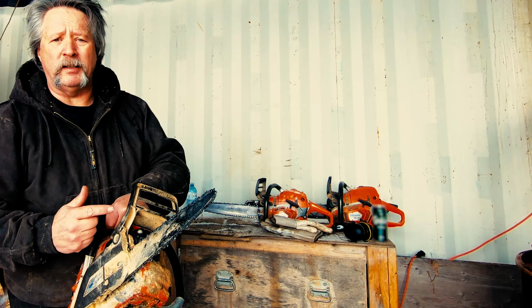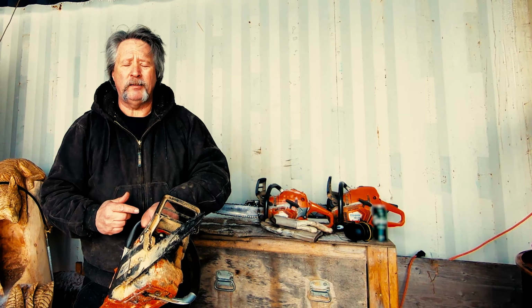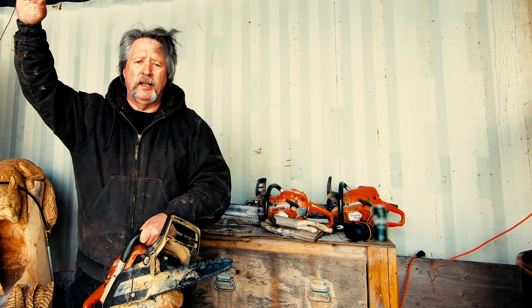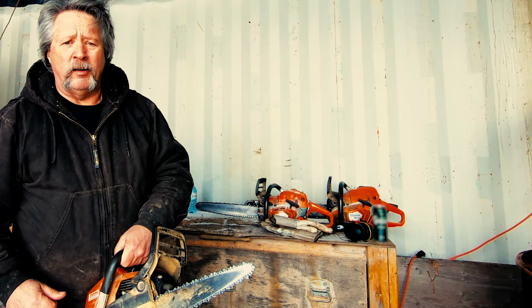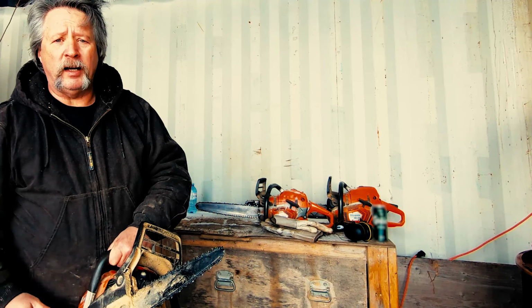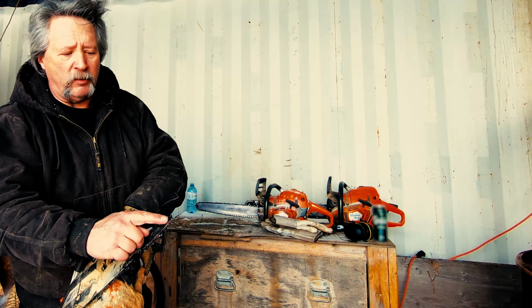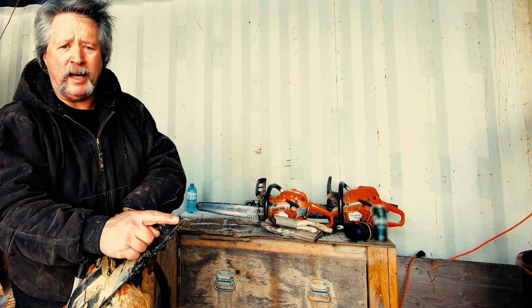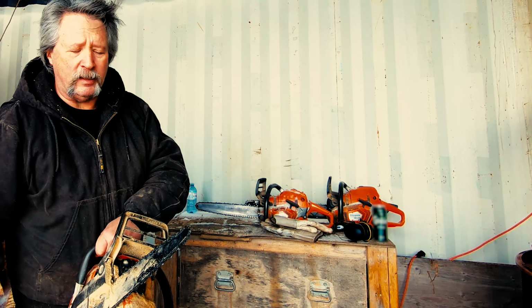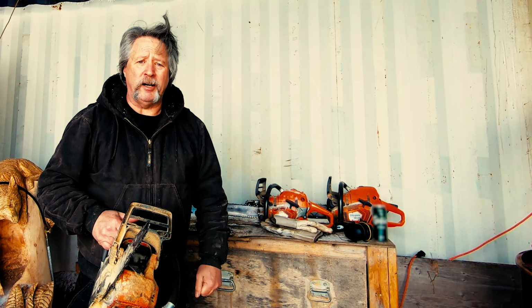most important thing. I mean, if you let that tip wear down just even a little bit, then it exponentially deteriorates over time, right? So if you have to every day pull it off and dress it a little bit, it's better than waiting until, you know, the tip's all knurled off. If you feel the tip and you can feel an edge on that outside of the chain drive, then you need to dress it. Anyway, that video will address that issue.